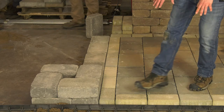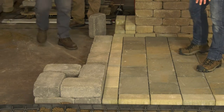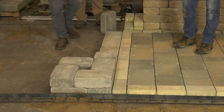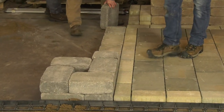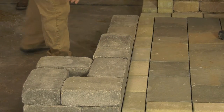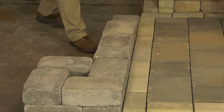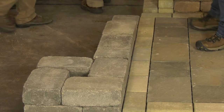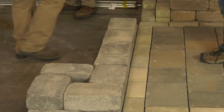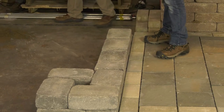We're doing what we call an accent row on our paver patio. We've got slate stone blue for the body, and then we're using a cream border. So we call that an accent border. Now, were this an installation at a client's home, we would probably mirror this color in an accent row in the seat wall and the pillar. We're gonna do that today, but we're gonna use a black paver just to show you the different contrasts you can create by switching up material colors. I think we've got one more half piece there.